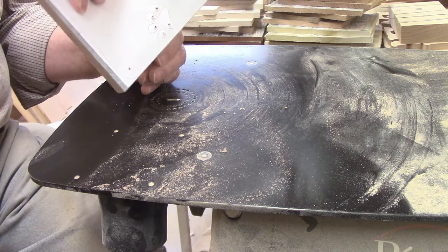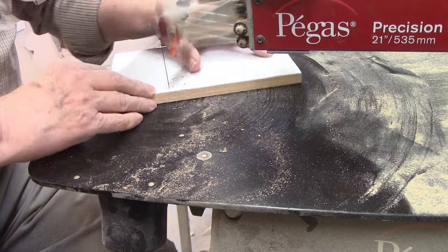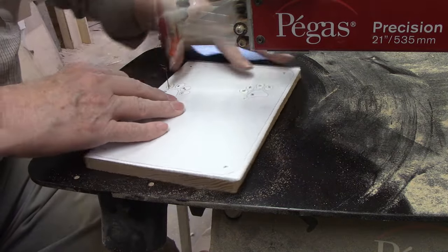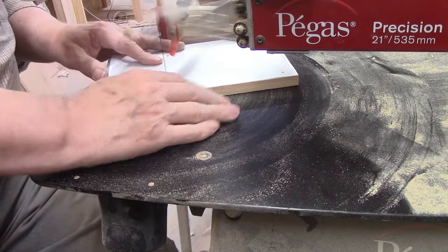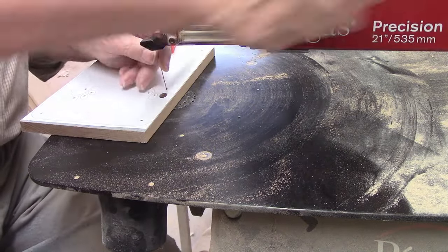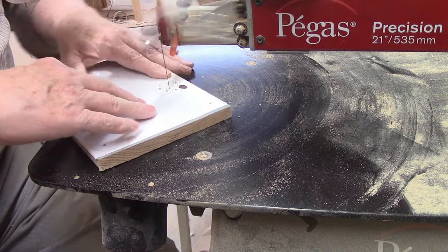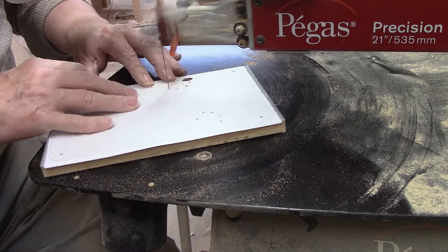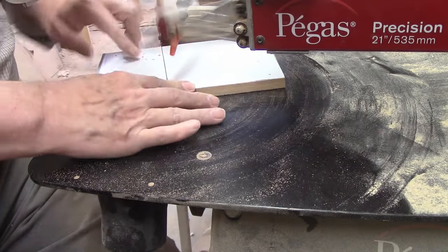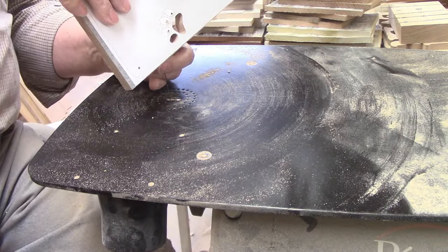With the dog completed, I can move on to the backer. The shape is simply a rectangle with rounded corners. The cutouts for the paw prints add some interest to an otherwise plain background. The cuts for the paws aren't difficult — it's just a matter of cutting from the pilot hole to the line and following the line around. With all these quick cuts in a row, I spend as much time threading the blade through pilot holes and tightening the upper blade holder as I do actual cutting. This is why you want a scroll saw like the Pegas — it's easy to thread the blade through pilot holes and tighten it with just a thumb screw. The Pegas scroll saw uses the same mechanism for the lower holder as well, making blade changes quick and easy too.